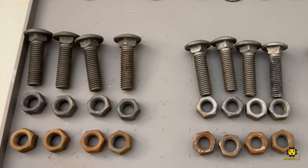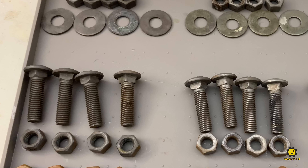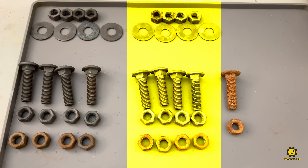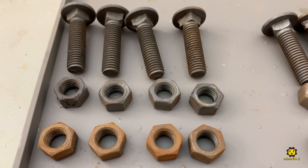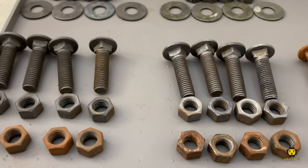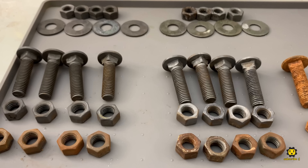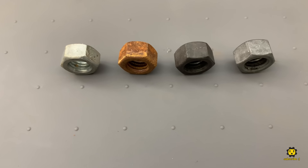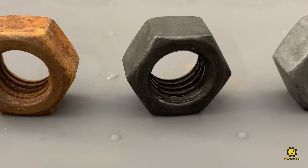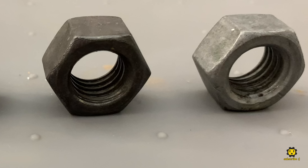48 hours later, and it looks like rinsing and re-dipping did help the rust inhibitor, but it's still not perfect. Crudcutter is on the left and Evaporust on the right. On the bottom are the original samples from our submersion test that had been rusting for about four days. I did dip everything from the sonic cleaning test in the Crudcutter, including the Evaporust. Here's a side-by-side comparison: a zinc coated nut, a rusty nut, the Crudcutter nut, and finally the Evaporust nut.